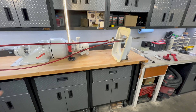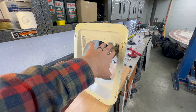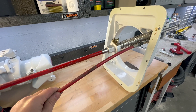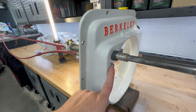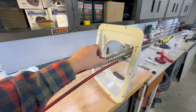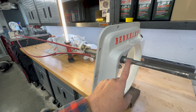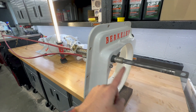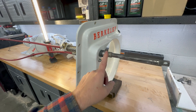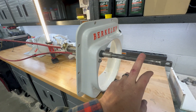Now that we have both cables set up, I want to go over it again because it starts to get a little confusing. The lower cable is out of the jetovator box — it goes into the front side of the transom and is bolted on. Our normal steering cable, this bigger cable on top, runs in with the new steering tube — we've added this additional bracket and spring. It goes through that plastic plug we installed. The steering tube will slide in and out of that plastic plug. We can also pull and extend the steering cable itself. There are basically two moments of movement here, versus the original setup where only the cable moved — now both the tube and the cable move.